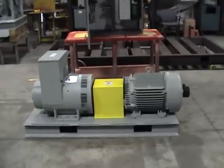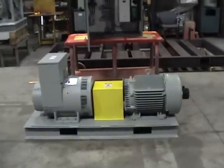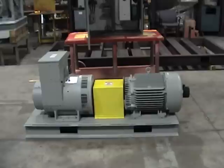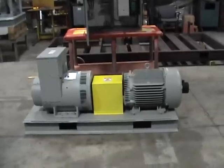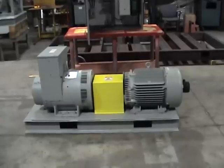The purpose of this video is to review the design and construction of Horlick 400SC model motor generator sets. These motor generator sets are used to convert frequency from 60 to 400 Hertz. They're built in sizes that range from 10 to 120 kilowatts. The system we're videotaping today is a 25 kilowatt unit.